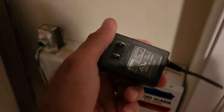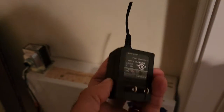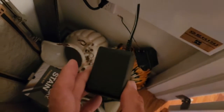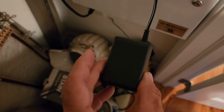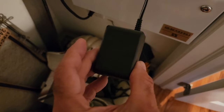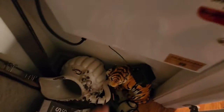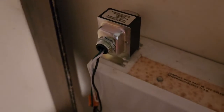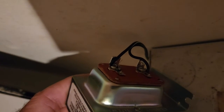This transformer was a DC transformer down here and it powered the AI doorbell. I cut that wire off and bought a new transformer — there's a link to it on Amazon. I stripped the wire coming out of the old transformer and plugged it on one side of the new transformer. On the other side, we go into AC — it's a 110V to 12-to-16 volt AC unit.